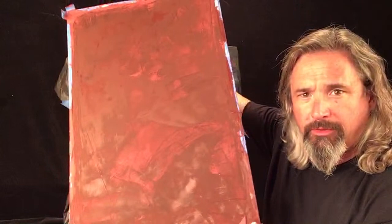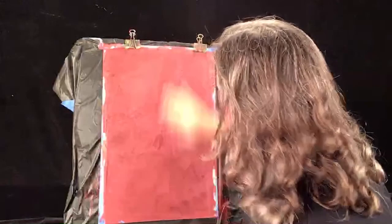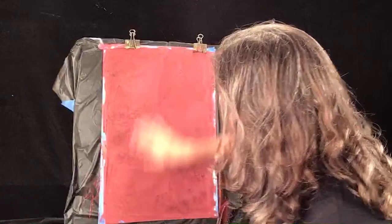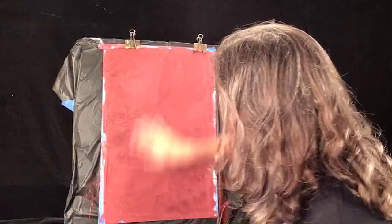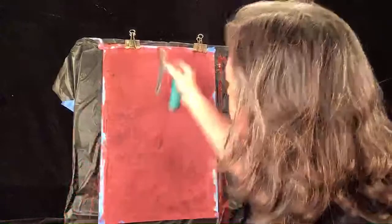Smooth. Someone bought Fermilux, two gallons for 80 square feet — you've got plenty. So this one is from earlier to get us where we are, that way you don't have to sit and watch paint dry. Now this would be my third coat — the burnish coat. We're going to put this on tight, pull it tight. While it's in that damp, humid state — as my friend Pierre always said, when the plaster is still talking to itself — everything works a lot more nicely.